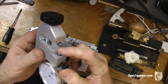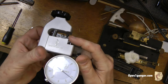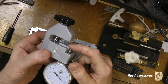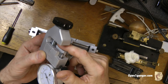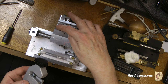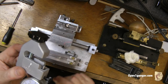The way to install this on the machine is pretty simple. You'll notice on here there's a plunger, then there's two landings back here, each with two little bumps on it, and there's a space between them. There's a top surface with one bump on it. These bumps are registration points that are going to be touching the gouger carriage. The guide goes in between these two bottom troughs and rests on these two flat surfaces on either side of the guide, and then the top surface touches up here and it sort of pinches — that's how you register this device on the gouger.